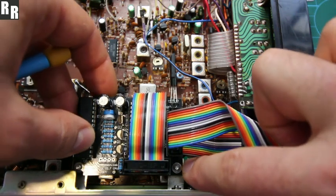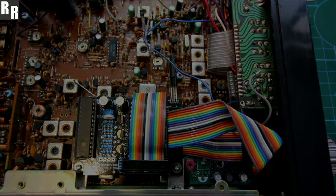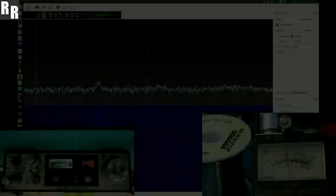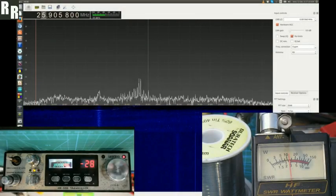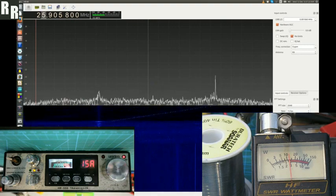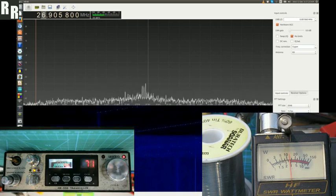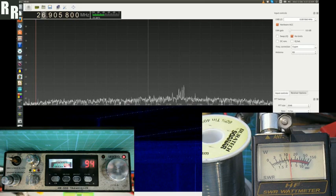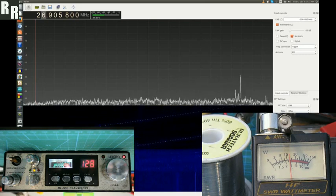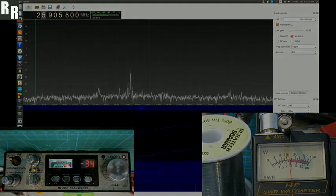When that's all wired in and configured, and obviously the radio is broadbanded with all the modifications to the VCO — yep, that's it. That's pretty much all the hardware. Full power there at minus channels. Watching the SDR screen, I'll scroll to the 26 MHz window so you can see it scrolling forward — practically full power all the way up to channel 100, 120, 130, 140 and all the way back, and it only dips right at that edge.